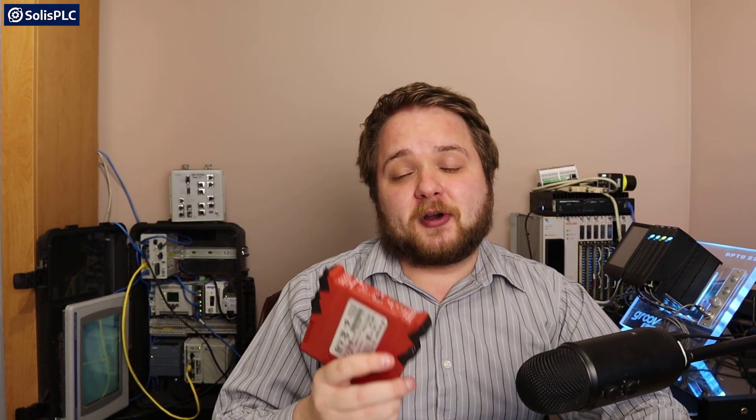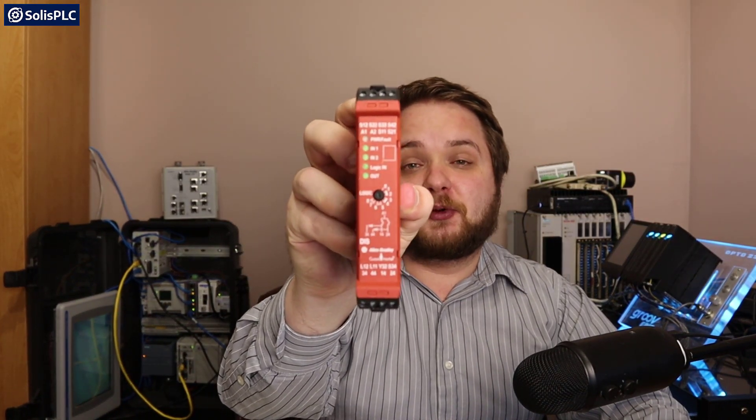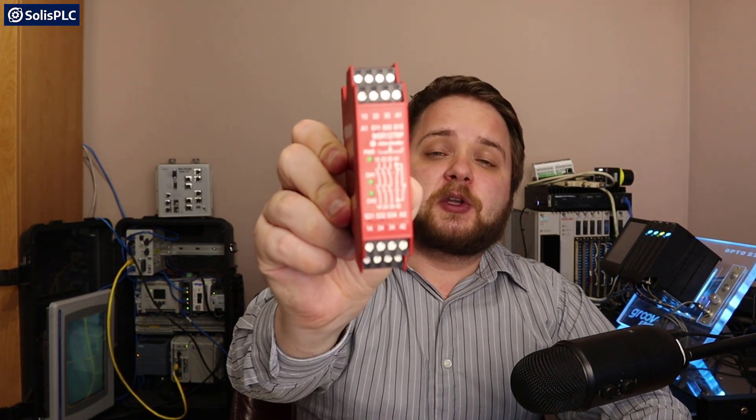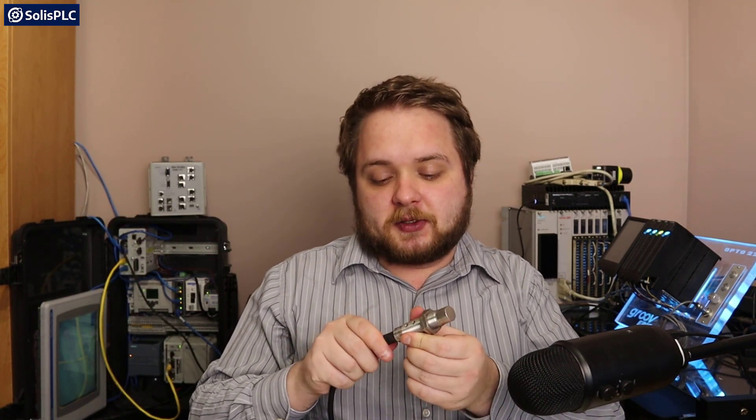So what I have on my desk right now are two guard master relays — one of the new type, which you might be familiar with if you're working in the industry, and one of the old type. The old style relay is a little bit simpler and uses less I/O. Still just as reliable but with some different features. We're going to be connecting a sensor, going through the color code used in these safety systems, using the guard sensor for this tutorial, and ultimately creating a fairly simple circuit that you can build upon once you understand the principles behind safety circuits.